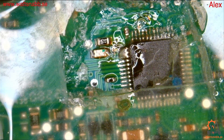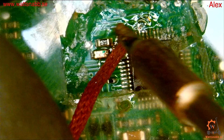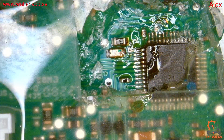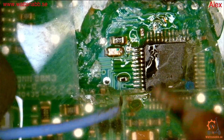This is really, really hard to do — I may need a finer soldering iron than I have right now. Now we want to solder the first pin, which is SWCLK, and this is the hard part because you have so little space here.